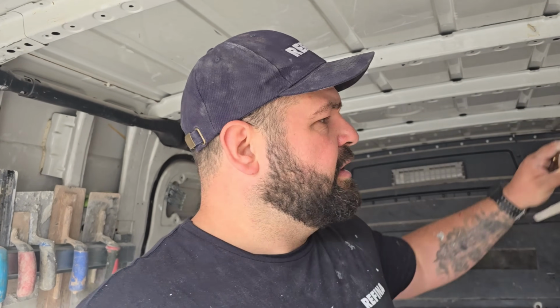But here's the kicker. With a gypsum based back coat, you don't actually need a key. The gypsum will stick to itself. It's only if you're using sand and cement and then putting gypsum on top of it that you need a key. Now, I've always just got it nice and flat, ruled it off, smoothed it with a trowel and then skimmed it. My dad used to give me grief over this because he was old school, brought up on sand and cement, so he's always wanted to put a key into bonding. Here's the thing, I've been doing it my way for years.